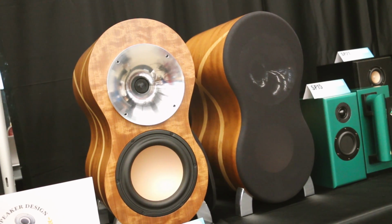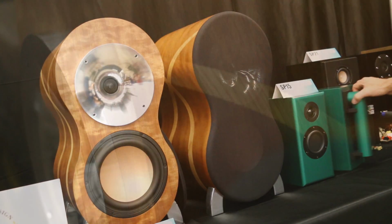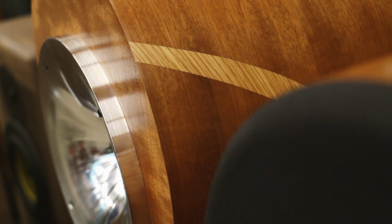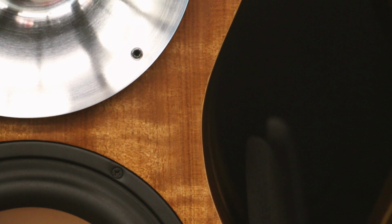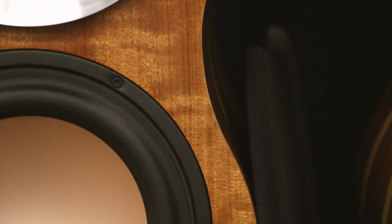Tell us a little bit about the peanuts. Peanuts are constructed of five layers of plywood, unevenly spaced, as a framework and wrapped with eighth-inch MDF that was heavily kerfed to get it to bend around the radius. The peanuts have a Hi-Vi 8 woofer and an RS-28A Dayton tweeter. The waveguide is out of billet aluminum. I turned it on a lathe.